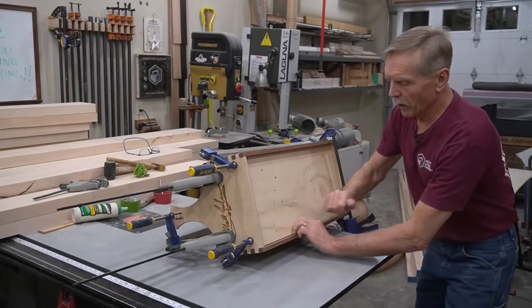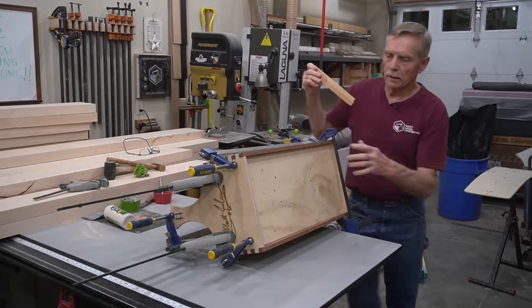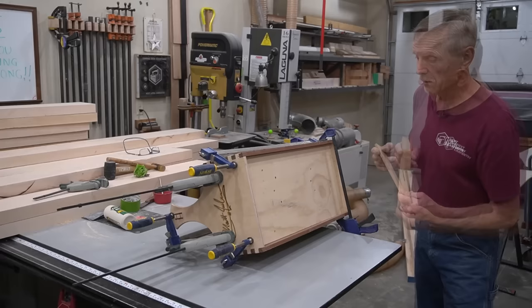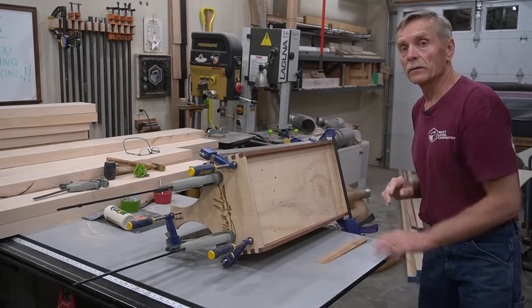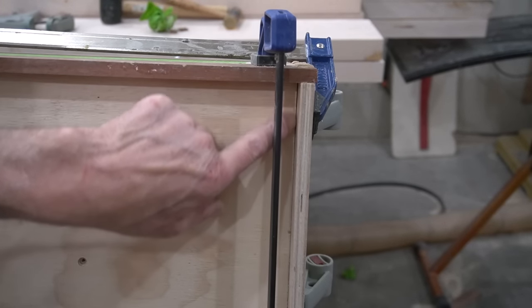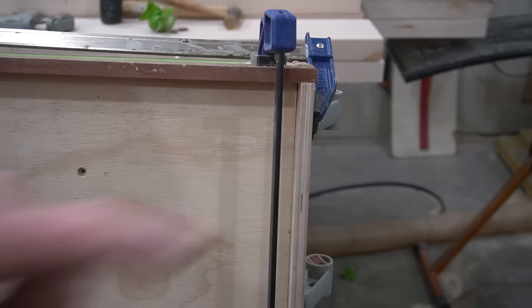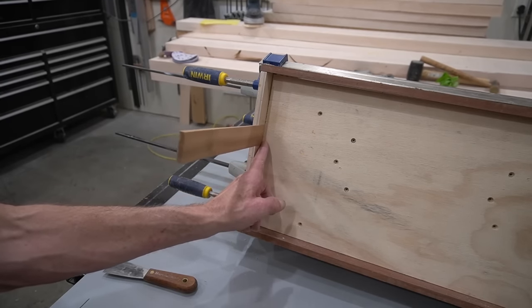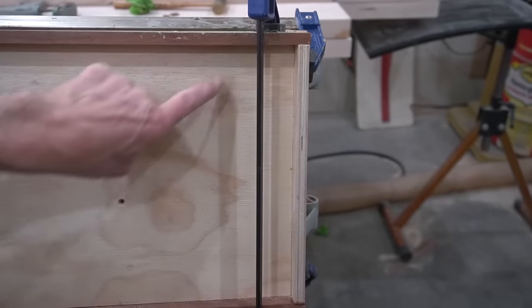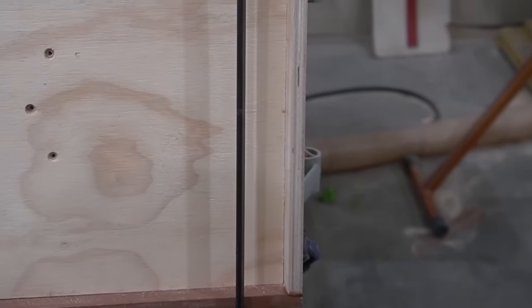And I've got it cut that way, so all I need to do to square everything up is to tap that piece into place and use a feather shim to rack it so it's perfectly square. Even though, as you can see by this little gap here, that this is very square already, but I'll still give it a little tweak to close that gap. And a feather shim driven into the gap on the opposite end of the tool tote quickly tightens the gap on the other end of the tool tote to ensure that the assembly will be perfectly square when the glue dries.